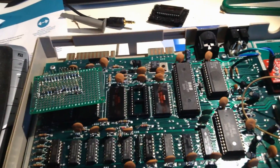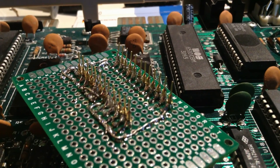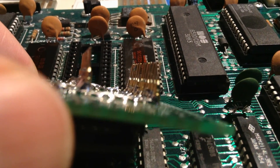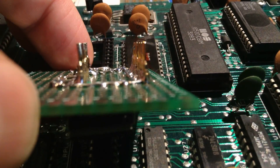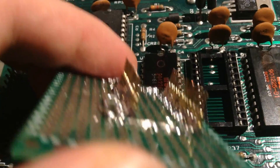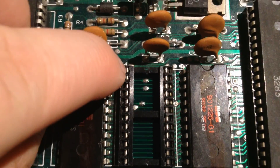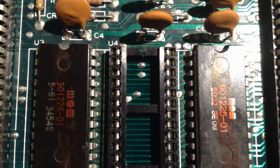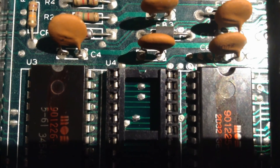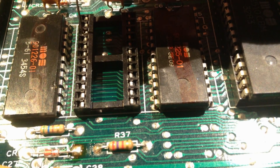I had a close look at this soldering of mine. You can see there's some solder on that pin over there — on the third from the top. And why is that important? When you're using rounded pins like this, you're basically damaging the socket. And if you look at the third from top, it might be a bad socket. On one side the contacts look fine, but here they look crushed — especially that one which had the solder on it. If you try to fix or bend it a little bit, you can see it just drops down without any force. But on the other side there's friction.